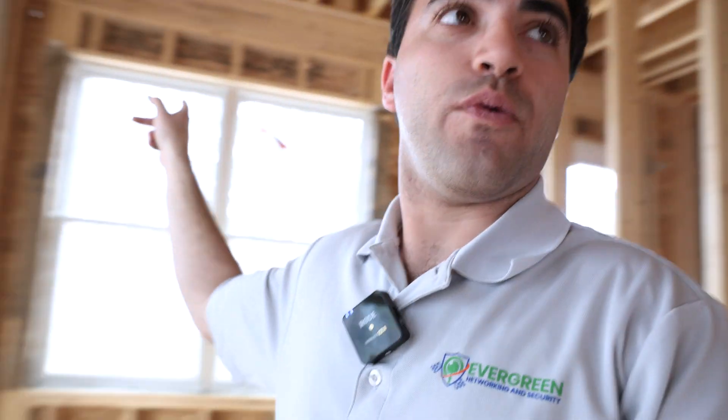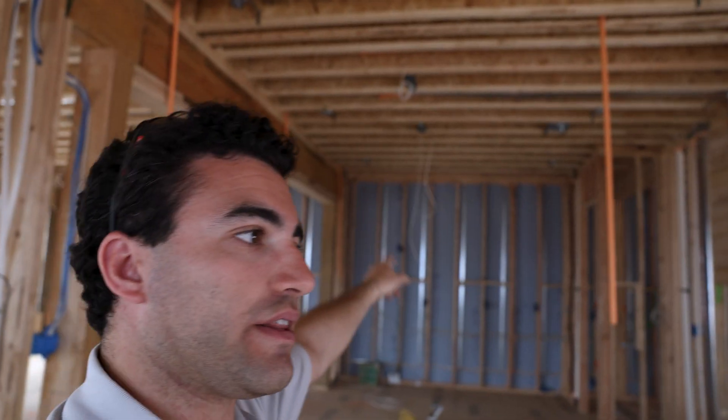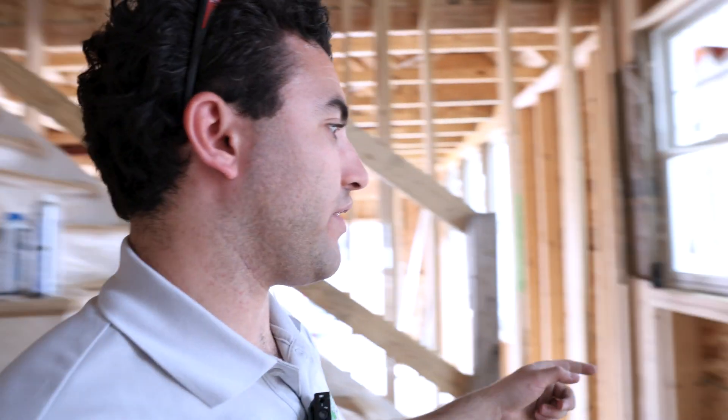Figured I'd just tune in and give you a little bit of an update of what we've gotten done so far. In the main family room we've got all of our speakers in, we've got our jumper wires in, we've got the inside and outside TV wired - they both have Cat 6 to them, one will be an IR trigger and the other one is for ethernet. We have our camera wired in the corner and the kitchen wired already. Upstairs is totally done. We have our doorbell wire for the door station and we're working on wiring the two exterior cameras - the garage door and the exterior front walkway. We've pulled about 2,700 feet of wire so far.